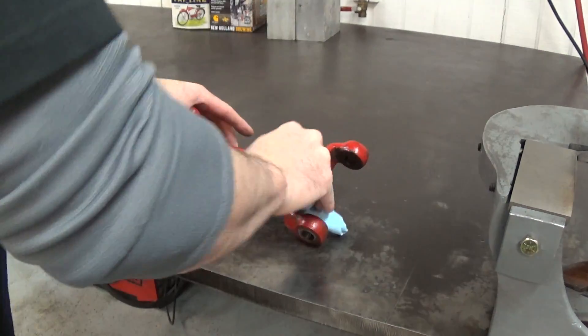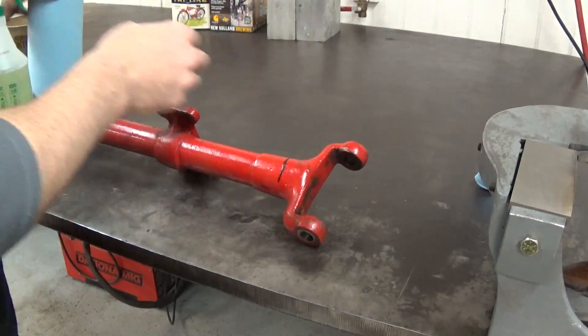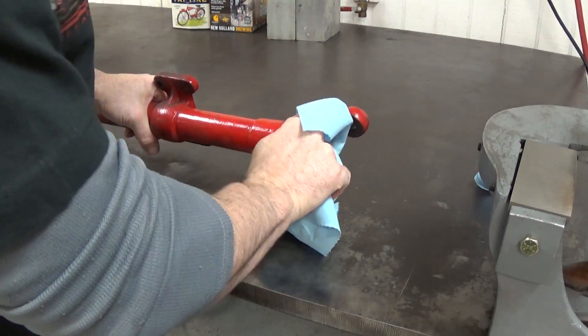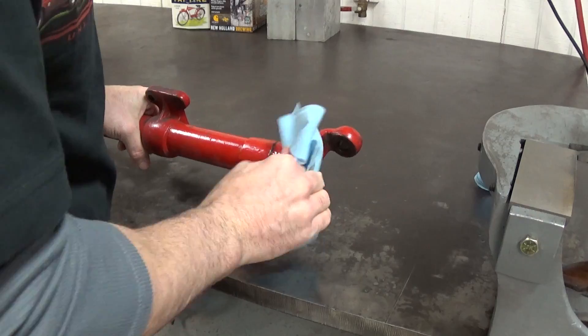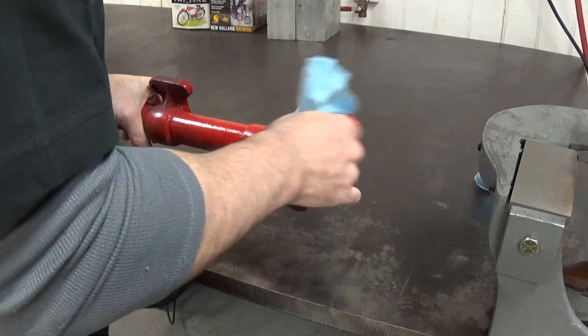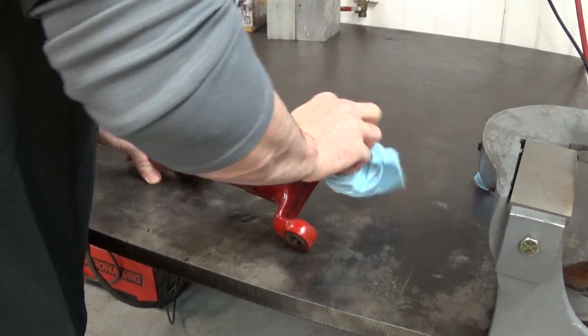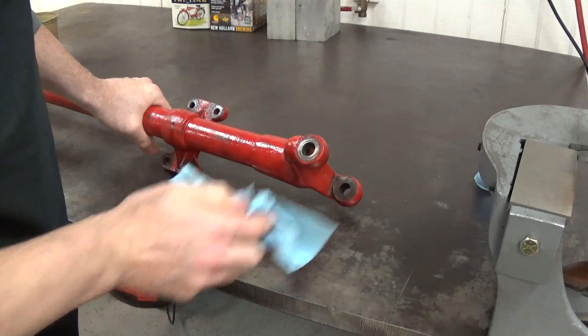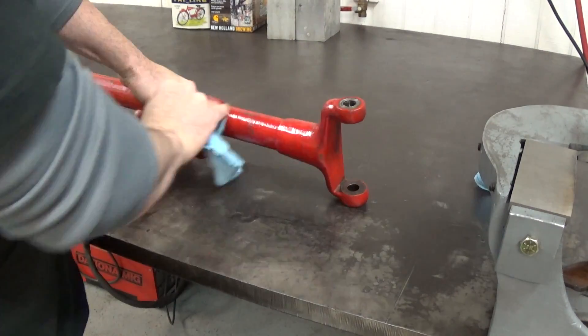This is our buddy Rick's. He drives it everywhere, puts tons of miles on it, and he's managed to develop a fatigue crack in the left-hand front knuckle. Luckily he noticed it in time. It's one of the prime reasons to have paint on a part — you can see the crack in the paint much quicker than you can in the metal.